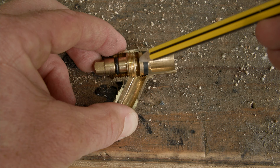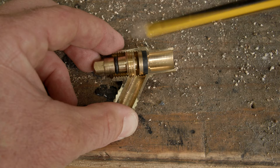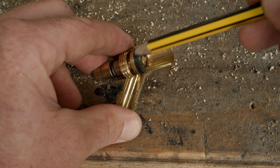Water on this side cannot get out because we've made a seal between the rubber here and this small seat. An important thing is that this rubber sits on this plunger here that moves independently and freely of what's exerting pressure to make that seal. It's really important because if the two were fixed, the rubber would spin round and score on the seat it was supposed to be sealing, and eventually, probably after about 10 uses, it would fail.